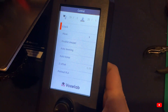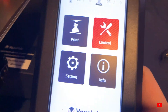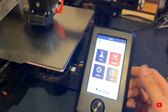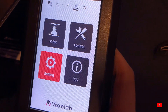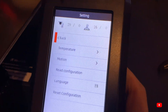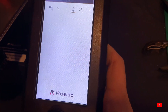Problem number two is the lack of settings in the firmware. I'm hoping Voxelab will update future firmware versions — and if Voxelab is watching, please add back core features, especially for a higher-end printer that can reach 300°C on the nozzle. Specifically, I'd like to see X-axis and Y-axis baby step configuration added back. We already have a Z offset setting, but having baby step controls would let you fine-tune the first layer height and handle complicated print scenarios like layer shifts much more easily.